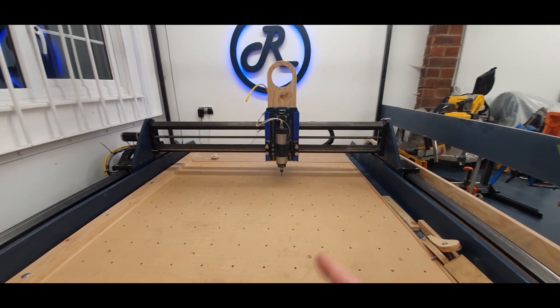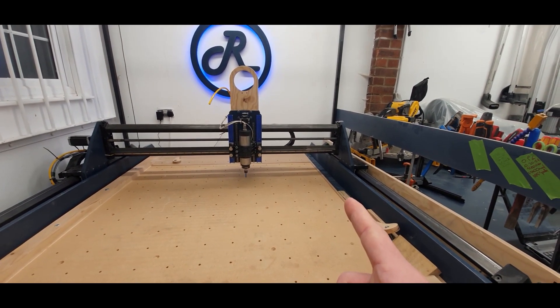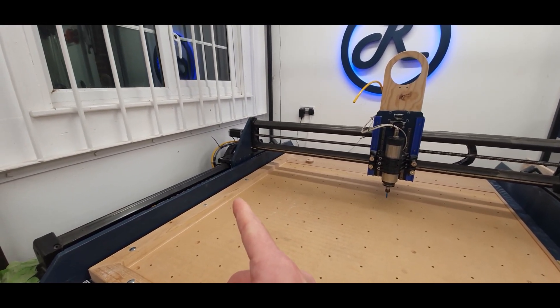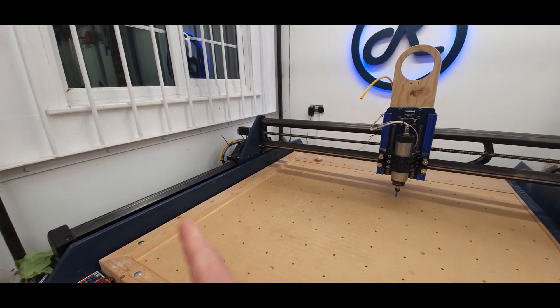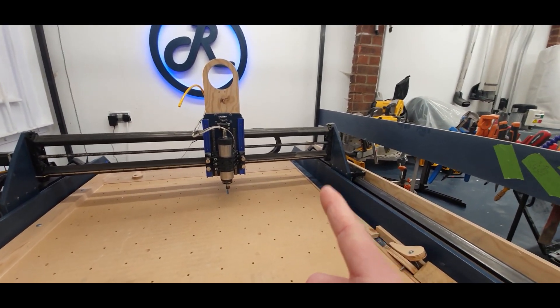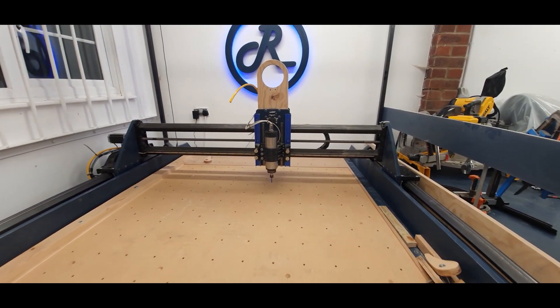This secondary axis will offset itself depending on the software. This axis is the primary rail, and everything should be perpendicular and square to that. The coefficients apply to the second Y-axis motor. I'll go ahead and do a quick demo of how to home it.